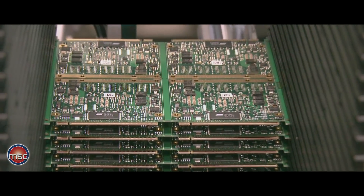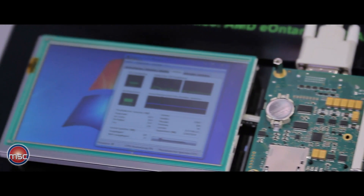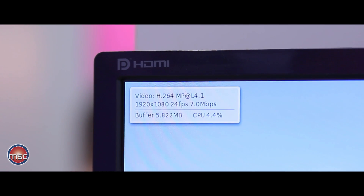The module offers a number of very popular interfaces. Graphics interfaces are supported — first of all, a dual-channel 24-bit LVDS channel to directly control an LCD panel, but there are also DisplayPort 1.1 or HDMI/DVI to connect to monitors of those interface standards. We are supporting dual simultaneous display, which means two different monitors — for example, one connected to DisplayPort and one to LVDS.